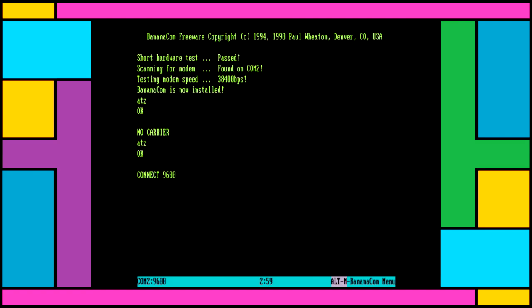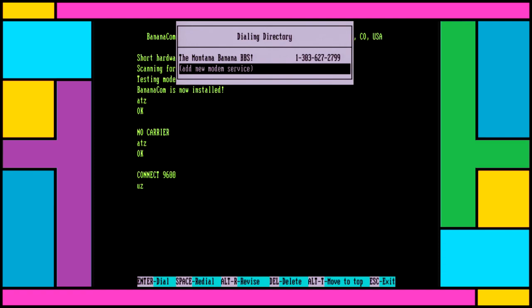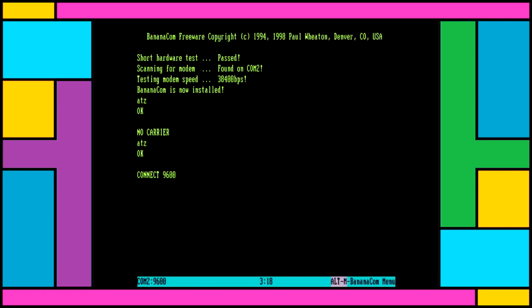It's not really a good idea, and it's much better then to just assume that these bread and butter things are always going to be in the same place, both in hardware and software, and that's why we can't just stuff things on any old interrupt or DMA or address, even if they're not in use, as well as being why our Turbo XT is PC compatible, and some other x86 or x88 systems, like some of those made by Apricot, I guess, using the same line of CPUs just aren't.